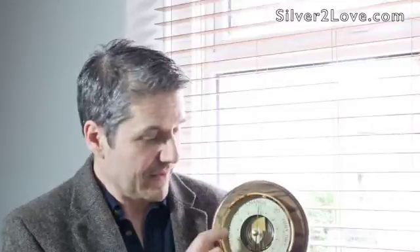How does a barometer work? It's very simple in its construction. It has a metal cylinder inside which is flattened — that's what that metallic silver colored disc is. If you look inside a barometer you usually see it with little undulations on it. It's filled with a partial vacuum; there's a little space in the middle. As the air pressure increases, the little disc gets crushed like a little lung, and as the air pressure decreases, it expands again.